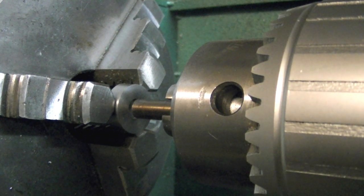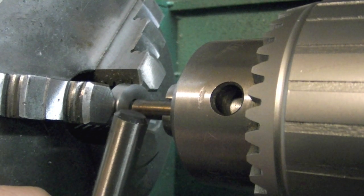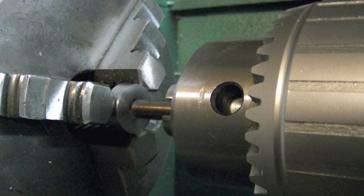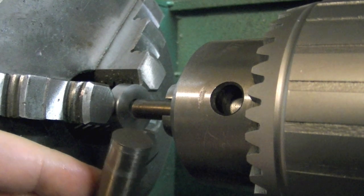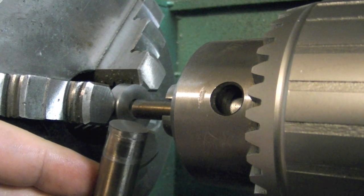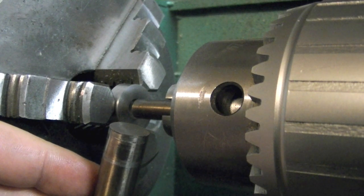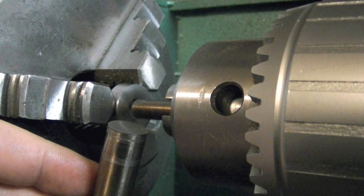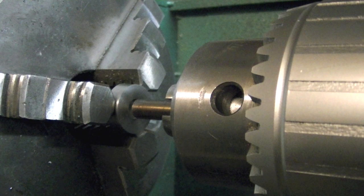For some of the larger sizes — from an eighth or a quarter of an inch on up — they work great as an impromptu punch. Now, one thing I will say: if you happen to have drill bits that have a chamfer on the backside, you're going to need to grind that flat until you've got a nice flat surface. And if you can give it a little bit of a cup shape using a small grinding wheel, that'll help a bit too.